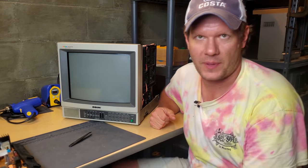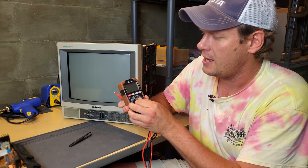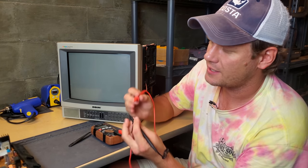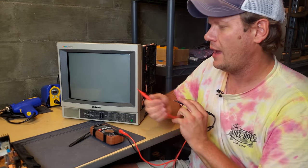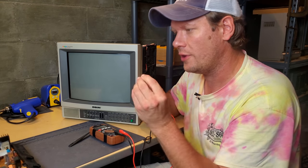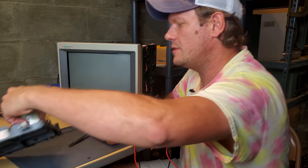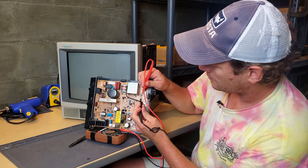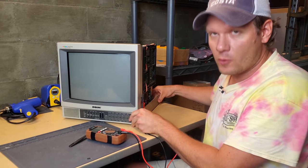Today for our test to see if I'm right about this problem, we need to use a multimeter. This can really be any multimeter as long as it can track continuity. So what I need to do is first put it over into continuity mode. When continuity mode is in effect, you don't have to worry about anything except listening for a beep, which means you have a current path between the two points that you're checking. That's the most important thing, because when the fuse blows, there will not be current passable through it. So just to give you an example, we're going to go ahead and test this fuse that I removed to use today. And you hear that? That is a good fuse. And if I do the same thing with this other glass fuse that's on the board, you'll also get continuity.